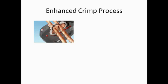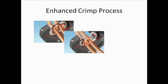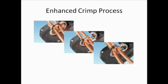To achieve IEEE Standard 837-2002 with the GCE 251-Ot connector, a special crimp process known as the enhanced crimp process must be used. First, the bundled connection will be inserted into the tool until it bumps against the locator and a crimp cycle will be completed. Then, move the tool so that the slot in the connector aligns with the locator on the die and crimp the part again. This puts the full tonnage of the tool on half of the part, providing additional compression. Last, move the tool back to the original location on the connector, seat it against the locator, and crimp again. This final crimp puts the full tonnage on the other half of the part, providing a connection that meets IEEE Standard 837-2002.